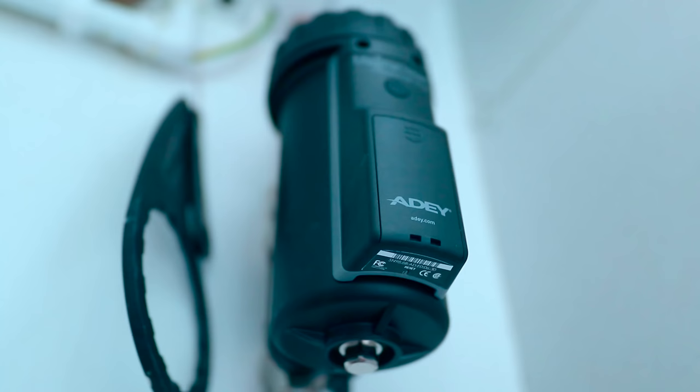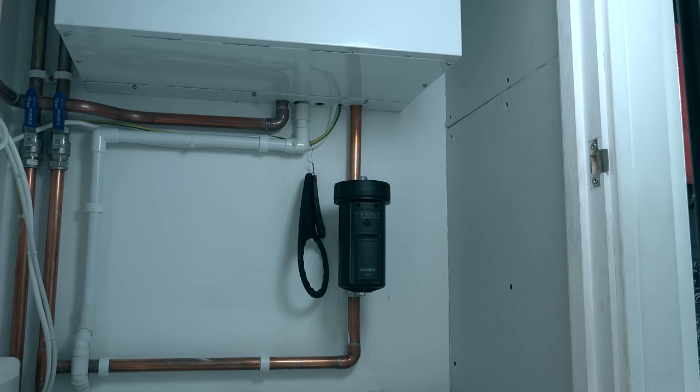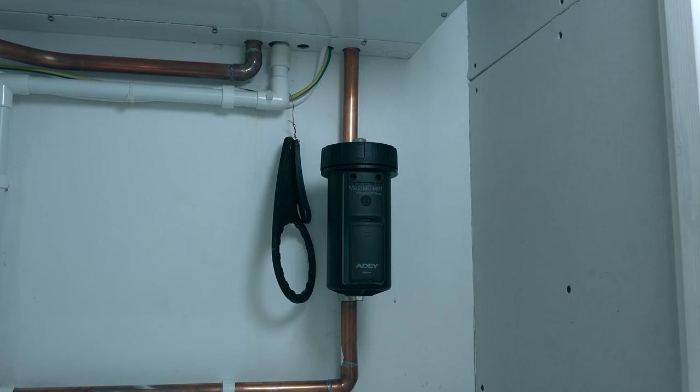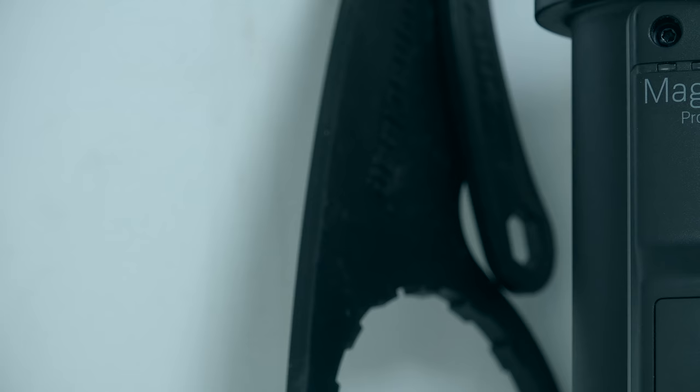You've all patiently watched me install that, and you've seen how easy it is to get one of these connected to the internet. Read the instructions. The biggest tip is to make sure you do all the connecting of the filter to the internet and all that setting up before you actually physically install the product on the pipework — it's so much easier when you're sat with it in front of you and your phone. My two biggest tips for a successful install: get it connected to the internet first before you install it, and take a reading of the internet signal strength in the position where you're going to finally install the Pro 3. If you want the chance to win one of two of these fantastic products, please click the link below to our competition — you'll find the terms and conditions and duration of the competition there too.